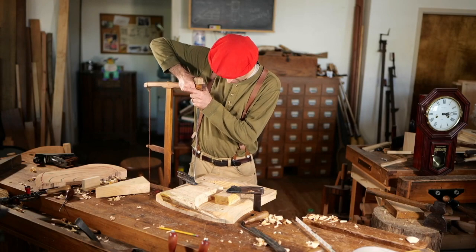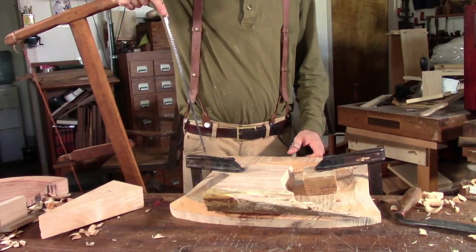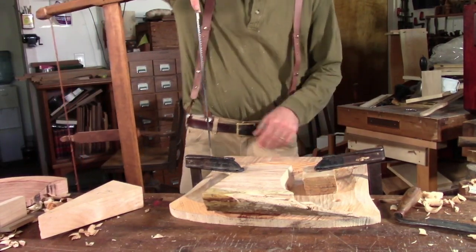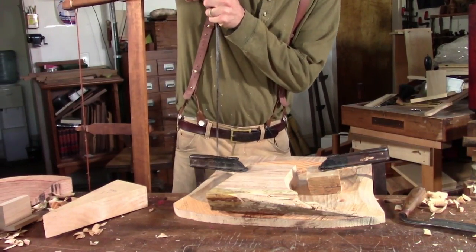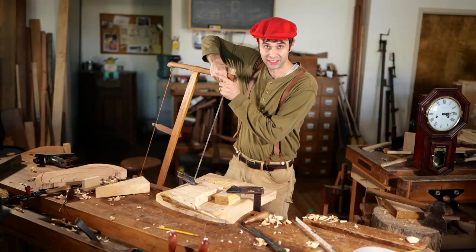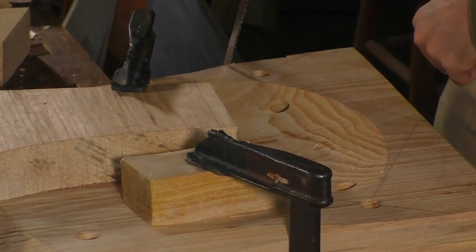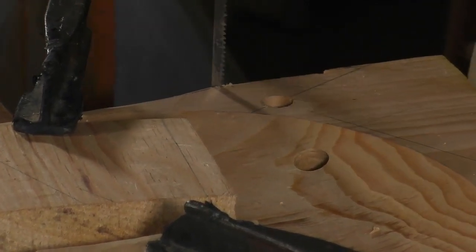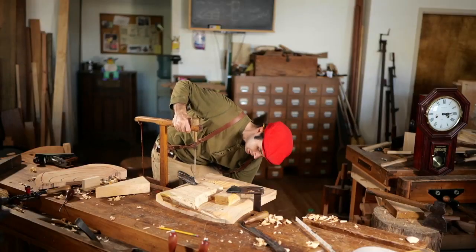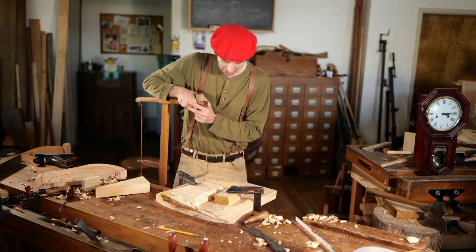I do find that sawing vertically works really well. It's really key that the web stays plumb. If you start changing the angle as you go around the curve of the back of the seat, you will start undercutting more and more, which does not make your job any easier. To start the cut I'm going to change the angle a little bit to nibble at that corner and get a little registration spot — a kerf — and then immediately go vertical. The old chair makers called this the 'dancing betty,' because you can stand here and go up and down all day long.